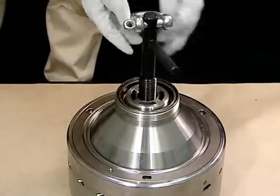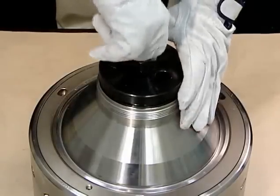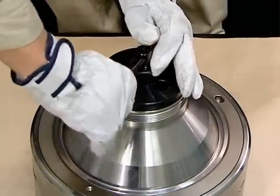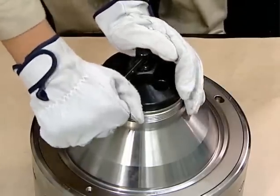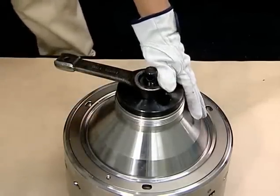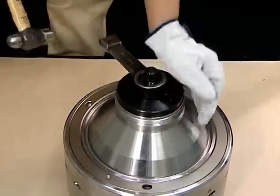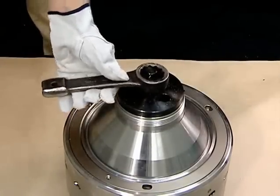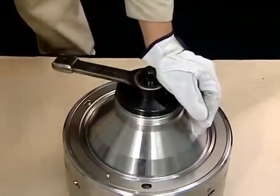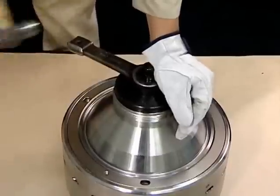After setting the bowl, remove the bowl lifting jack and set the disc clamp plate. Screw the push bolts of the disc clamp plate into the guide tubes and firmly tighten the hexagonal nuts with the hammer. This procedure is important — its purpose is to dampen the springing effect in the disc mounted on the bowl, to protect the thread of the bowl nuts and make it easier to release the bowl nut.